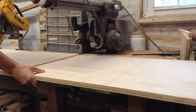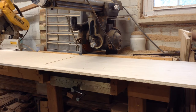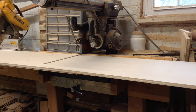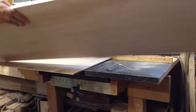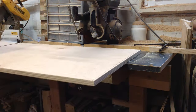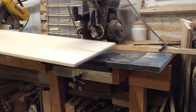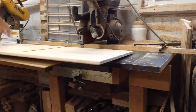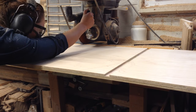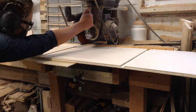I'm cutting that center dado first and then cutting it on the backer. I'm putting a shallow dado on the backer — I usually don't do this, but I had to shim it with a quarter inch piece of ply so that it's the same thickness as the three-quarter. That's because there is no base for this unit — those vertical panels are essentially free floating. I thought this was a little overkill in the beginning but I kicked those bottom panels so much in my shop I was happy I took the time to put dados in the backer as well as the top so it gives me a more solid joint. If they were butt jointed with screws I think it would have knocked them out of place, and if you're putting this on top of harder material to screw into you'll be happy you put those added supports in there.